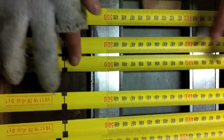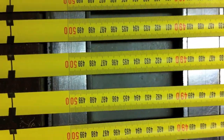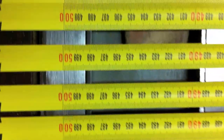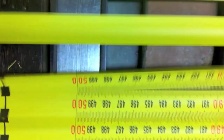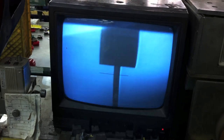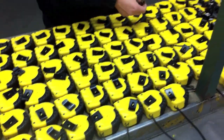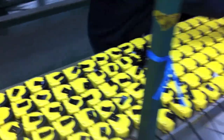These machines are massive. Here we're checking for precise calibration — you can see the lines of the aluminum plate, they must line up exactly or they'll be rejected. The next step is we have to hole punch the end to put the hook on. There's a calibration mark that has been printed on every blade and you can see it lining up here with the computer screen. Once it lines up, it punches the hole and the hook is installed.